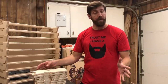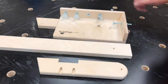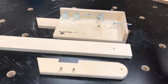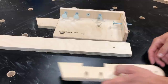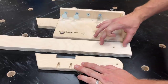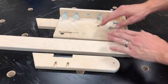What we need to do is reproduce that leg the hard way first, so feel free to go back and watch that video. Then I'm going to talk about how to make a jig to reproduce that leg. A jig is just a device that helps you reproduce the same action over and over with very little effort required. This is my leg jig. It's going to help me reproduce that perfect leg we just took great pains making the first time, so we don't have to take as much effort to do it again. When we made the perfect leg, we also made a perfect frame, so we want to reproduce the hole placement for both parts.